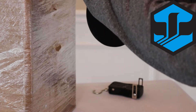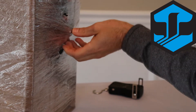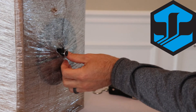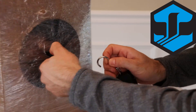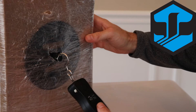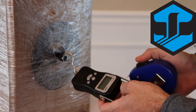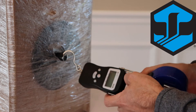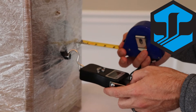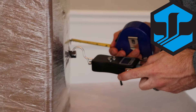What we will do is slide the pull plate behind the stretch film — I've already punctured a hole here for it to come out to. This is where we're going to hook up our measuring device. Since this is still mechanical, what makes this tricky is you have to hold the tape measure with one hand because we need to get a four-inch pull. That means we're going to pull this plate out four inches from the product while holding it in place to measure our containment.